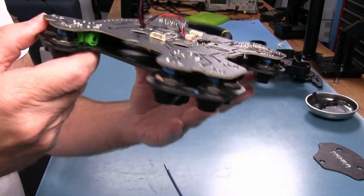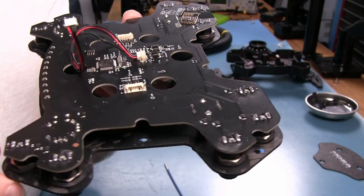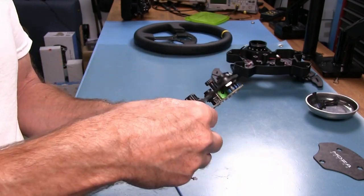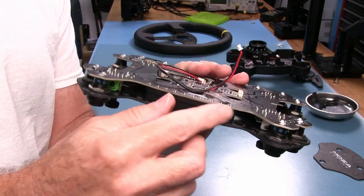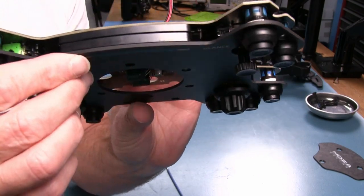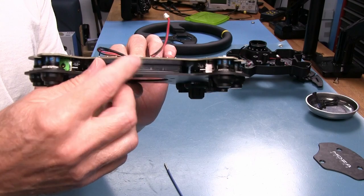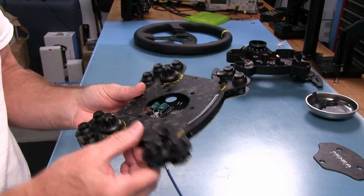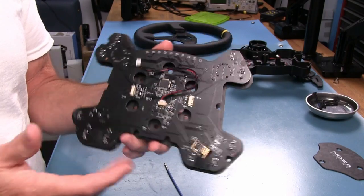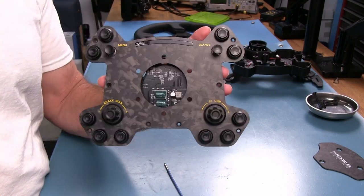Looking deeper in, you can see the through-mounts for the controls. The little pins have been cut back flush, and these are the LEDs. On the FSR wheel they had black tape around them, but here there are plastic pieces that keep the light inside each chamber so it doesn't bleed out and lose intensity — that's why the lights are so bright. You can tone that down in the software. Overall it's a well-done, professional-looking layout, consistent with all the Moza products I've reviewed.